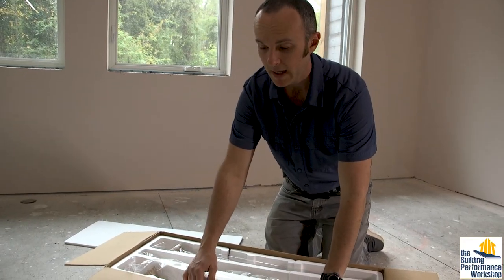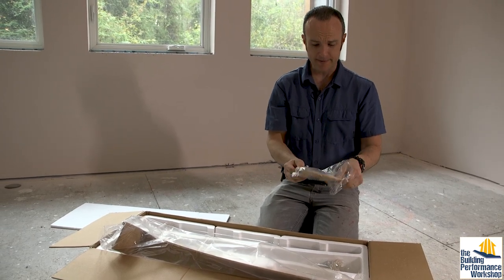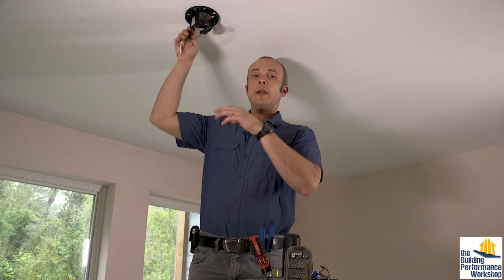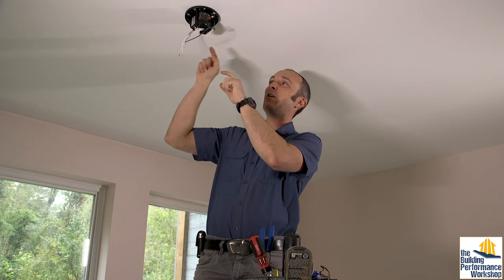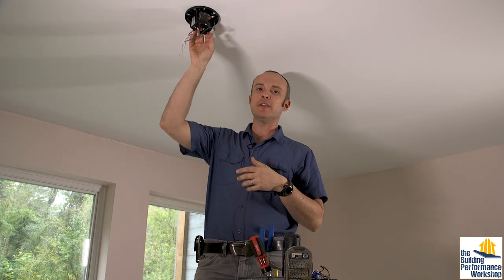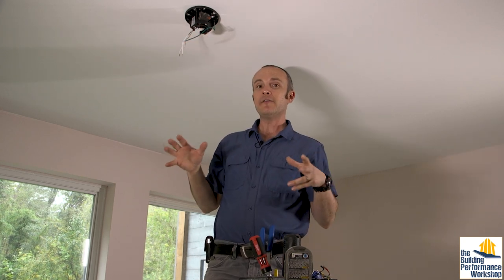This fan is the Wrap Custom — that's the name of it — and it comes with three blades. We also have the cap that goes on the bottom, which would be replaced by a light kit if you got one. Now I've got the cage attached to the outlet box in the ceiling, and that outlet box is attached to the structure. That's really important because this thing does weigh something — it won't max out the 35-pound capacity of the outlet box, and I know it's attached to solid structure.